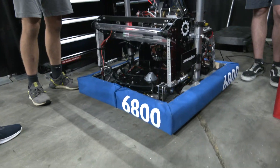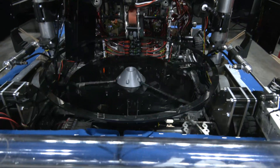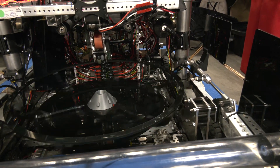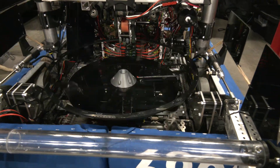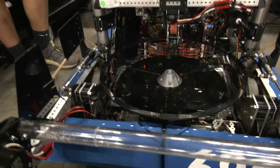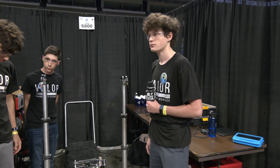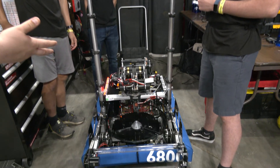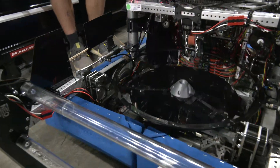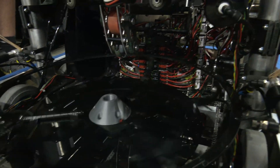Before we bring in a power cell, let's go over and talk about the Spindexer with Cooper. Our Spindexer is pretty simple — after coming out of the intake, it runs at a 67-to-1 ratio on a NEO 550. The entire Spindexer is attached with a single nut and washer, so it's easy to take in and out. It has some small dividers in the middle to help force balls into the throat and shooter mechanism. With smaller dividers, balls don't get pushed into the throat too early and are allowed to flow around more easily.